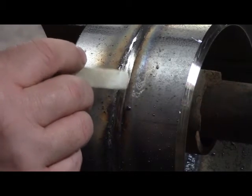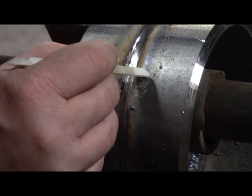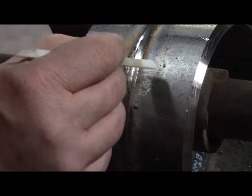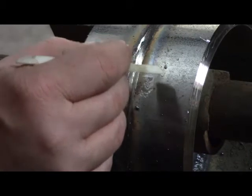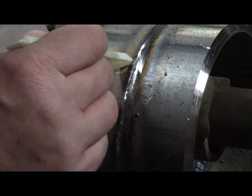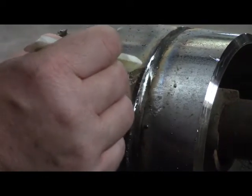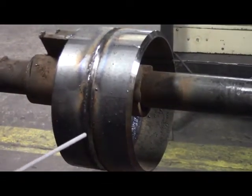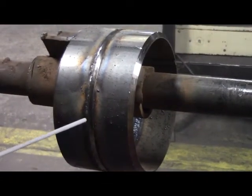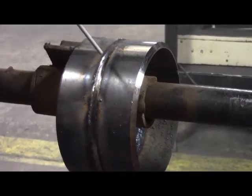If you do not fill it enough, that slag is going to be tough to break out of there. Some welders will go side to side, some will do a Z — other welders will have different techniques. I've just found this is what works for me. You'll see me just making a U with it, pushing up the sides of the pipe. I'll light up my electrode on the side and make that U technique going through, changing my rod angle as I go up.